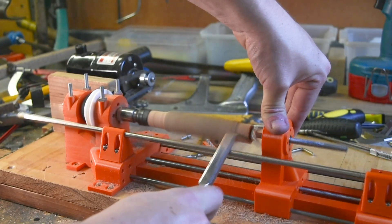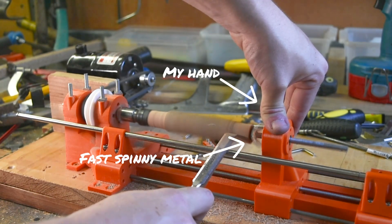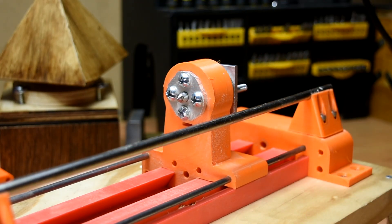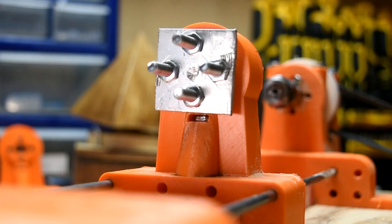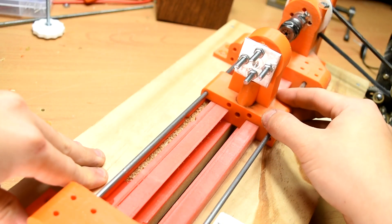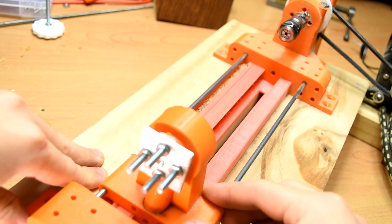To fix the first issue, previously I was holding the tailstock down with my hand, which is obviously not very safe. So to fix this, I redesigned the tailstock so that the same clamping force that my hand was applying could be applied in a more convenient fashion. The tailstock now has a hole running the length of it, with a space for a captive nut higher up. The rod sticks out the bottom of the tailstock and through the bed, which is now designed with a channel to accommodate this.